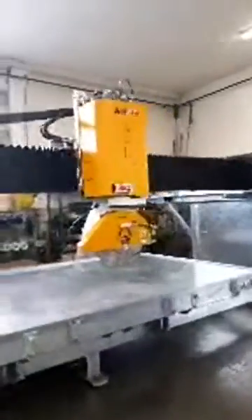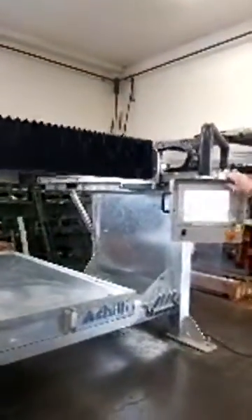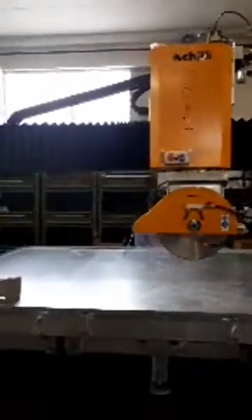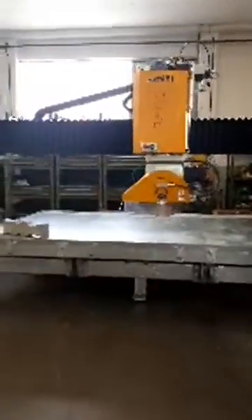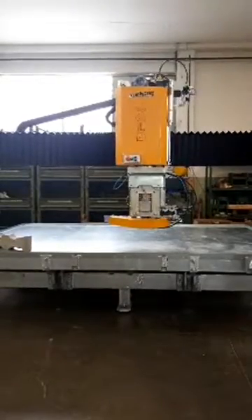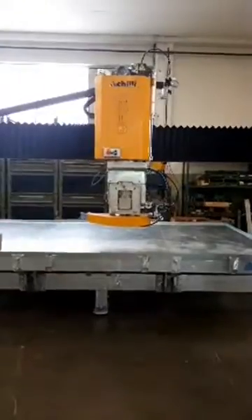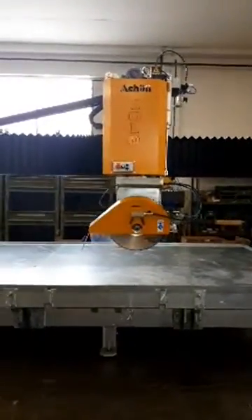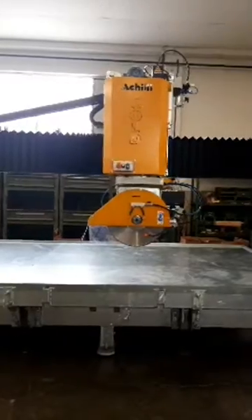That covers all the information on the MBS. Now I will proceed with some details on the Gold, our best-selling bridge saw in recent years. We believe this model achieves an excellent compromise among quality, ease of use, and value of the investment. The machine in front of us is a CNC 5-axis bridge saw, or perhaps better described as 4+1 axes. The working dimensions are slightly bigger than the MBS: X travel is 3900 mm, Y travel is 2350 mm. Blade diameter goes from 350 to 500 mm, with a distance between the blade and the work table of 15 cm.